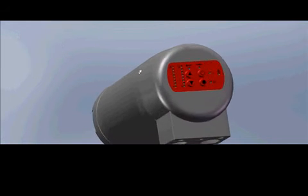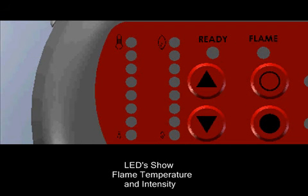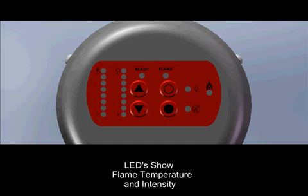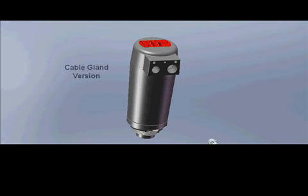Combinations of these measured properties are utilized to provide superb discrimination in a multiple-burner, multi-flame application. As well as monitoring flame performance characteristics, such as peak flame temperature. Paragon scanners incorporate three internal flame relays for customer BMS interface, eliminating the need for a remote amplifier.